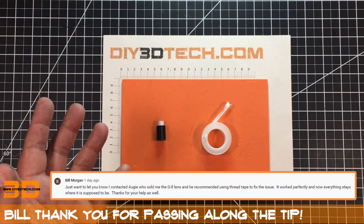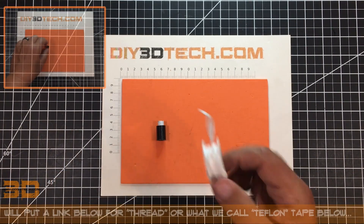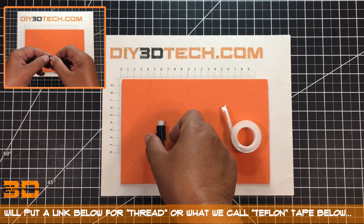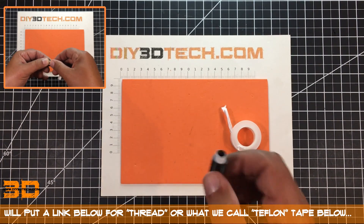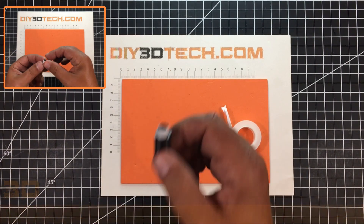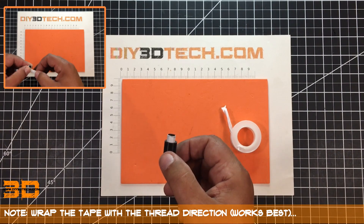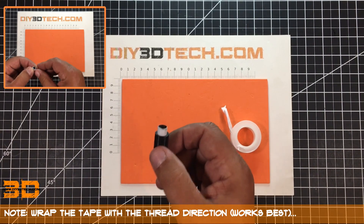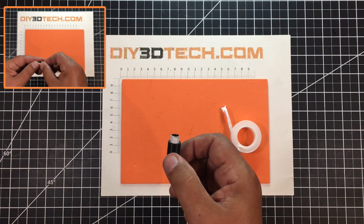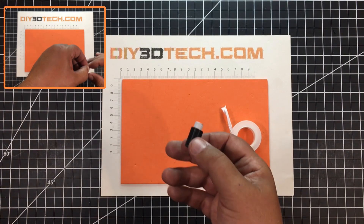So I went ahead and I tried Teflon tape. I kind of like the idea. I took some Teflon tape — the width of the tape is about the width of the lens — and I put it on the entire lens. This is going into the barrel of my Air Assist unit so it fits in there snugly. What I've found is about two wraps of Teflon tape, very tight, seem to work to keep it snug. You may have to play with this a little bit. Just watch you don't get it over the lenses and that the lens openings are clear, and you should be good to go.